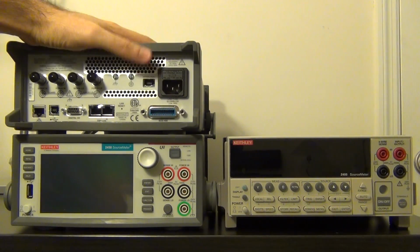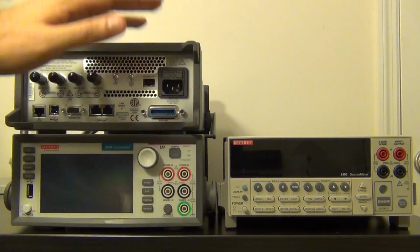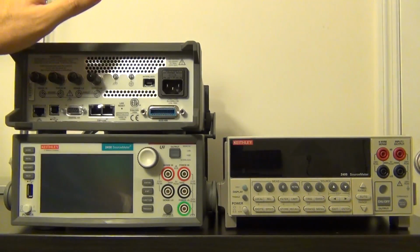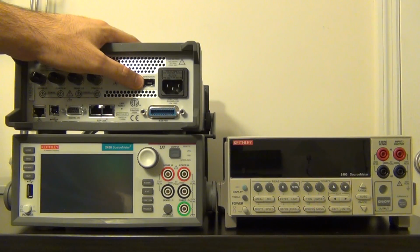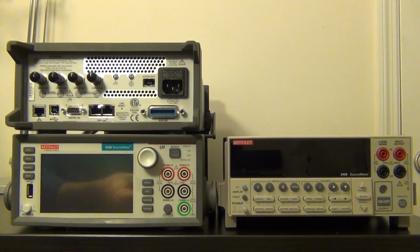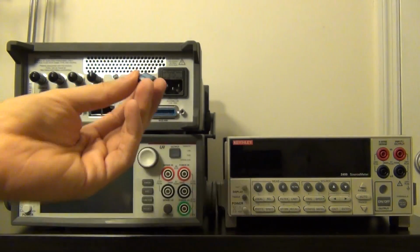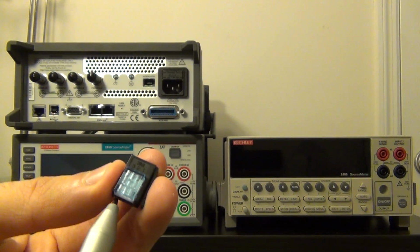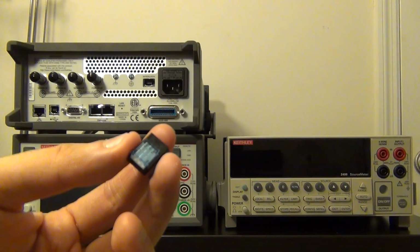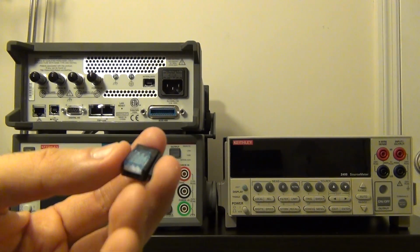So it's useful in a training environment, a university environment, to have an interlock that's disabled by default. If it's unplugged, it counts as being disabled, so that you don't accidentally damage something. And Keithley will send you a little connector like this, which directly plugs in there, and you can put cables in here and have them connected to something else to either dynamically change the interlock or permanently switch it.